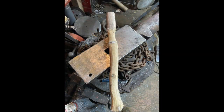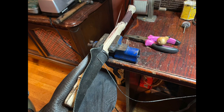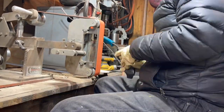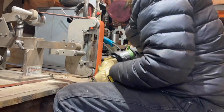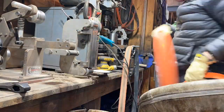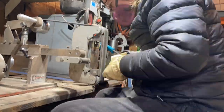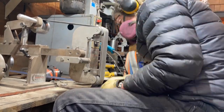Meanwhile, time to move on to the axe handle, made out of hickory. I'll refine it a little bit, put some curves in there with a leather hand-stitched wrap on the top and bottom. Moving on to sharpening the edge — end up with a forged finish and a sharpened polished cutting edge, going through different grits of sandpaper from coarse to fine.